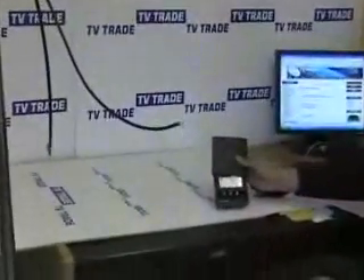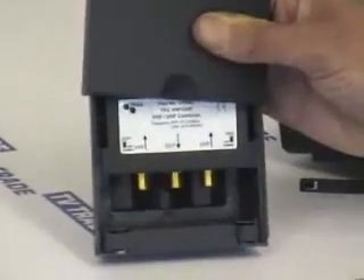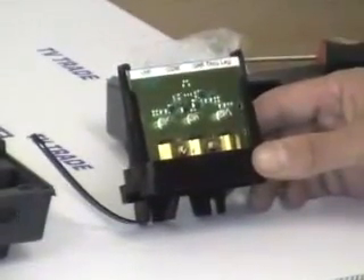They work in exactly the same manner. You have an F-type diplexer here — this one is supplied by Triax. It has a VHF input, a UHF input, and an output coming back out, which will feed a distribution system or a number of televisions via a splitter. Alternatively, you have exactly the same type of product but this time using a saddle and clamp mechanism. These are normally cheaper and not quite as handy to install, yet they can be just as efficient and effective. So there's a VHF, a UHF, and a common output — two feeds in and one feed out.